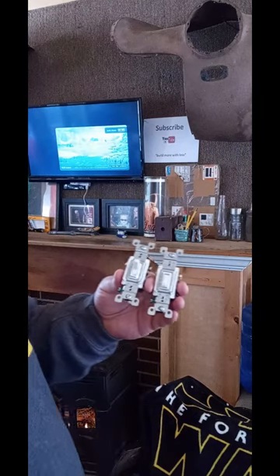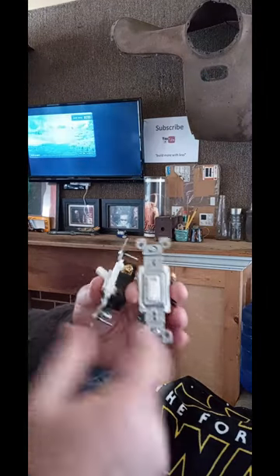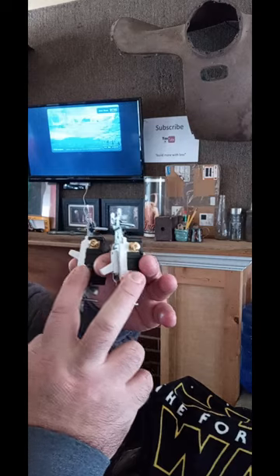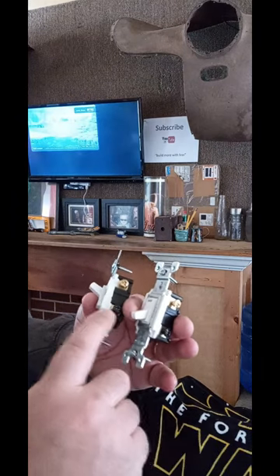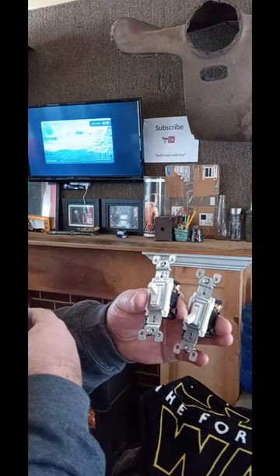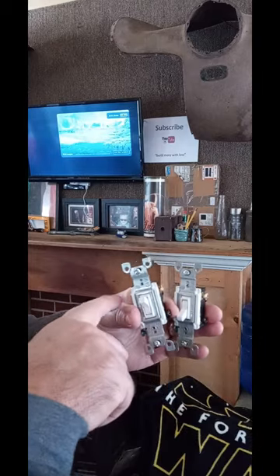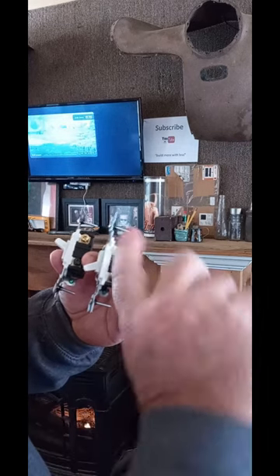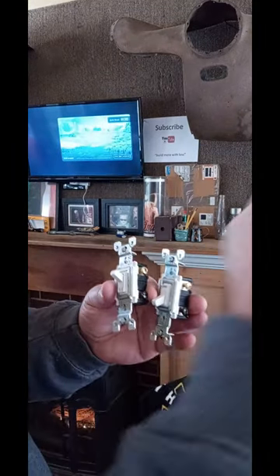As always, it's still black on brass, white on silver, green ground. In this case you see there's three screws on a three-way switch, and these are painted black — they're brass but painted black, and that denotes that this brass-painted-black screw is your power wire. So from your box, your power black wire goes to here. You have two other wires, whatever color they are, going between the switches, and this black wire goes to your light. Your white neutral wire comes through the box and to the light.